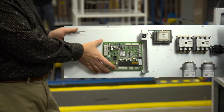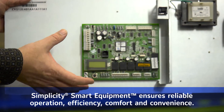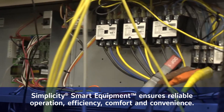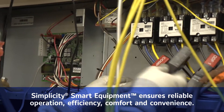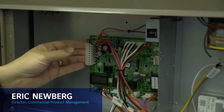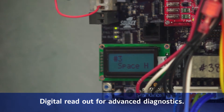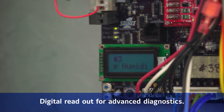This is the main control that we're calling our Simplicity Smart Equipment. It's the unit-based control that takes over management of all of the various components in the unit. The majority of installations are done with just basic thermostats, and we made sure there was a lot of access and availability to get to your thermostat connection. A lot of unit-based controls simply have LED lights that flash to tell you what the control is doing — we moved away from LEDs to actually having an LCD display.